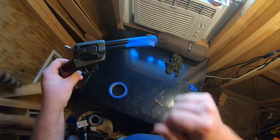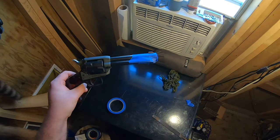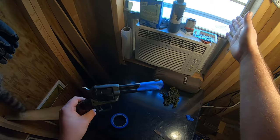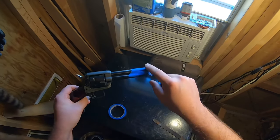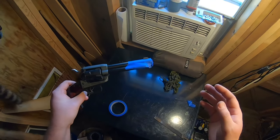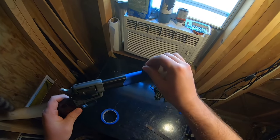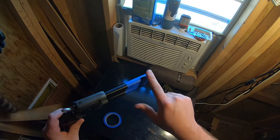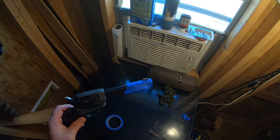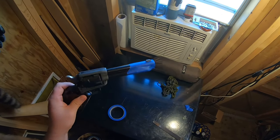It's easy enough to bring this sight around to make it more accurate. I came back with Birchwood Casey's Plum Brown — I can actually see the sight a lot better from the rear when aiming than I could when it was blued. You could also use Birchwood Casey's Perma Blue cold blue solution with a Q-tip to touch up the areas. After filing, I used a smaller file to clean up and round the edges, then sanded with 400 grit and then 600 grit to slick it up. She's good to go.